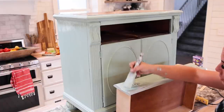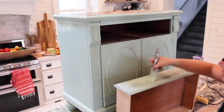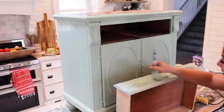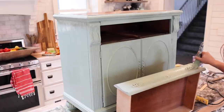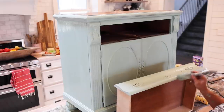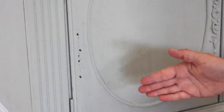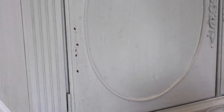The first coat I did on the drawer I had watered down, so it didn't get super good coverage. On the rest of the piece it was more just to make it not look streaky. I'm still not worried 100% about coverage because I'm going to come in and distress and wet distress. I might even come back and highlight some of the carved pieces with a contrasting paint color. You have to trust that the overall look is going to look good. Sometimes it chips through the base color, sometimes it doesn't — in this case we're seeing some of the gray, and this is going to give you that layered chippy look.